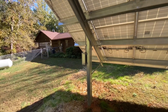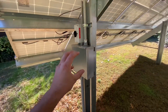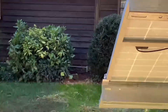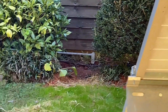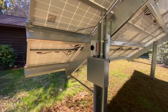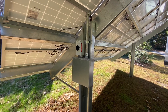This is how we always do our pull boxes, and it's nice to have a tall box when you're pulling into something. At the other pull point, you can see I've got an LB or an LL or an LR — I always forget. If it opens that way, it's an LR, and if it opens that way, it's an LB. That's the conduit fitting I'm talking about there. This is how we do 99% of our pull boxes on solar arrays.